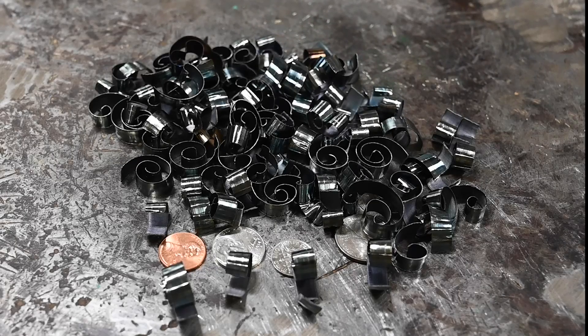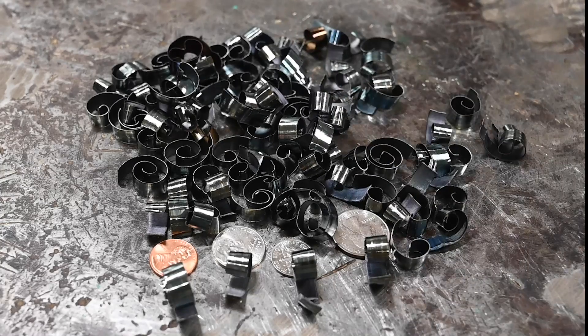I'd love to get a big piece of shafting — something like four and a half to five inches in diameter of a free-machining material; 4140 would be great. Then dial it in with some turning and make some real consistent curl-over chips with the right insert, and just go bananas on the depth of cut until we can't anymore. With the facing cut your surface speed is literally changing throughout the cut, so it's hard to get consistent results — but it's still pretty fun. That kind of depth of cut for a home shop machine — I'm feeling pretty happy with that. Thanks for checking out the video, guys, and leave a comment below. We'll see you hopefully very soon with another video.